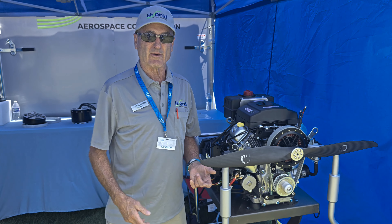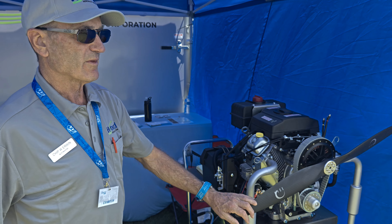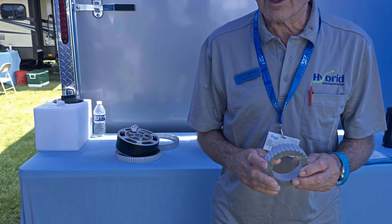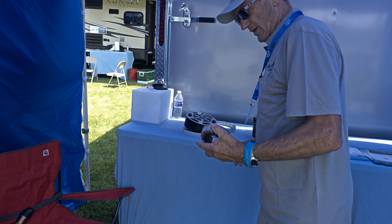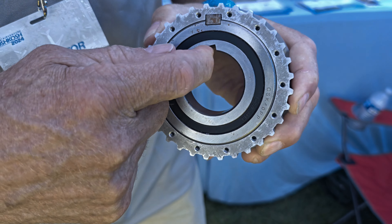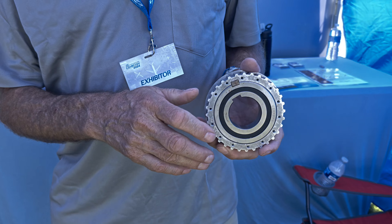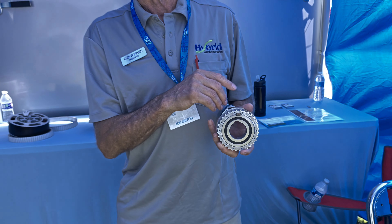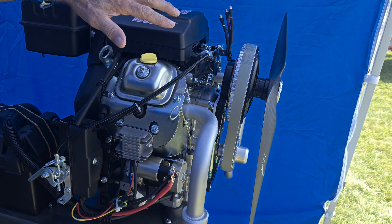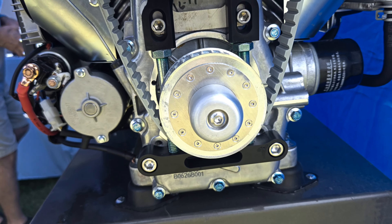You don't really need about 10 pounds of battery. We're only going to put a 1 or 2 kilowatt-hour battery in this because you're only using this for takeoff assist. The slipper clutch is here — this is the bottom pulley on the PTO of the engine. You can see it easily turns one direction but doesn't turn the other direction, which means you can spin the electric motor without having to turn over the gas engine. It'll spin freely and allow the electric motor to operate. Or, if you put power to both, then you get power from both power units.